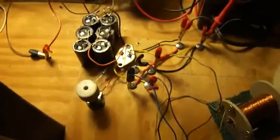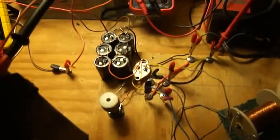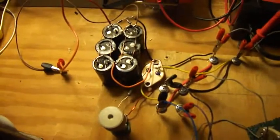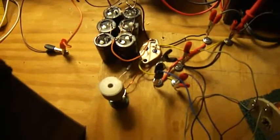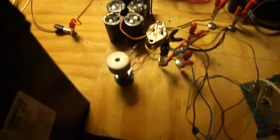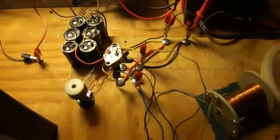But the output is totally different. I have taken away the single diode from the output and put in the thing we call the voltage doubler to take its place. It's connected between the positive of the run battery and the collector on the transistor to give us our output.